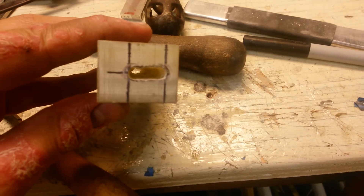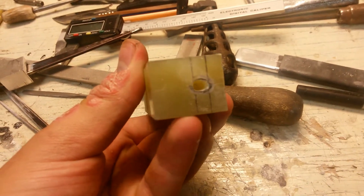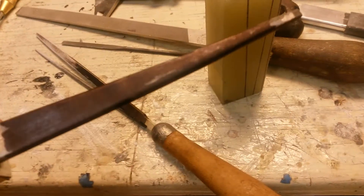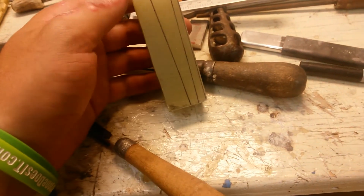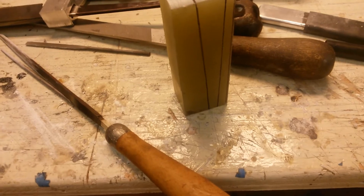There's a little bit on the side there, mostly in the bottom part, so I'll probably have to get a little file to get in there. Just a quick little tip — I find it helps a lot. You can also see on the tang where it's rubbing off, which makes things a lot easier rather than just trying to figure out where it's coming from. You can remove material exactly where it needs to go from and keep sliding the handle block further and further on.